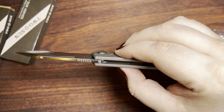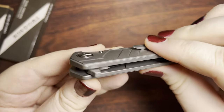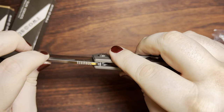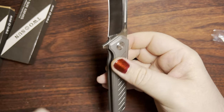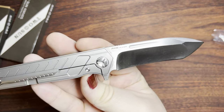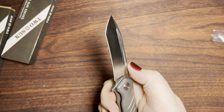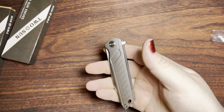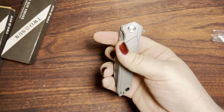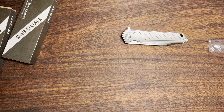So that's kind of interesting. We've got a stop pin that's really deep in there — it happens right before the flipper tab. So it's not really affecting the sharpening choil too badly. Yeah, this is the TS-360 in D2 steel. Jimping basically right where I would want that sort of thing. We have a little bit of a fuller in here — kind of reminds me of a comet, but it's really, really tucked in there. Unless you've got much smaller fingertips than I do, that's probably not going to be useful for a reverse flick.